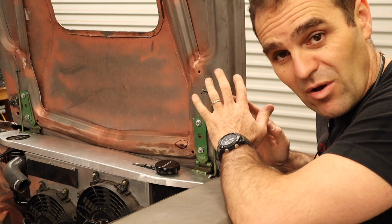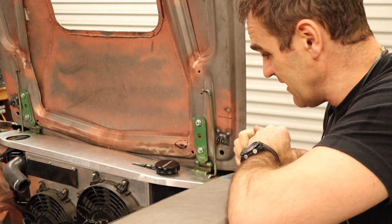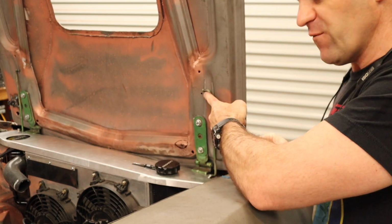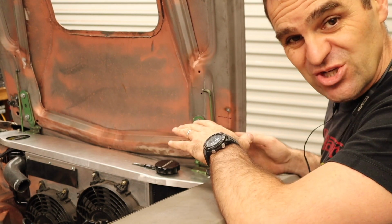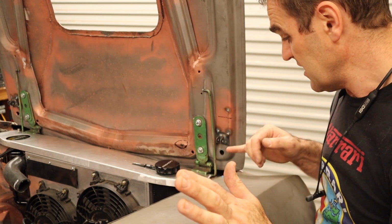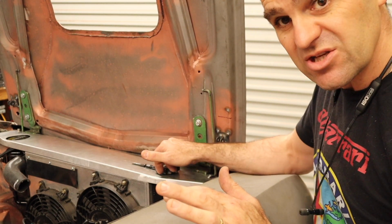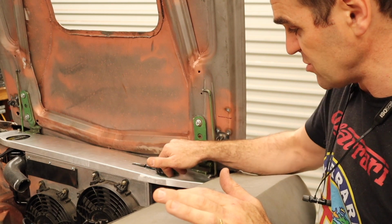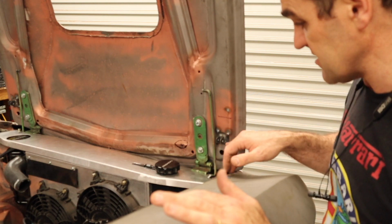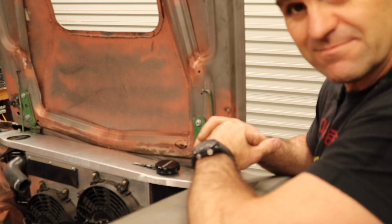All right, so I had to assemble everything again to work out where I'd gotten up to, because it's been a while, and I'm just refining this panel just so that it looks nice and neat and fits in with these torsion bars. As I mentioned earlier, I did put in the gas struts, but they were never going to work, and definitely not as good as these original torsion bars. I have noticed that actually the filler cap for my radiator is just touching the bonnet here. So I'm going to trim this area out and make a little patch panel, or at least I'll trim it out while it's on the car. I can make the patch panel later. Make sure it clears, and then I can start disassembling again, now that I know everything is going to fit, and put it back to the way it's supposed to be.